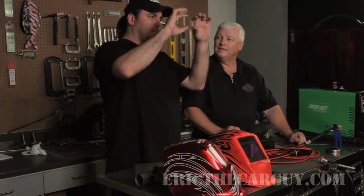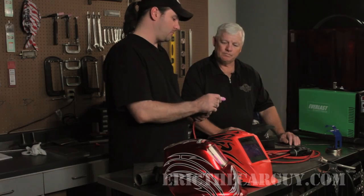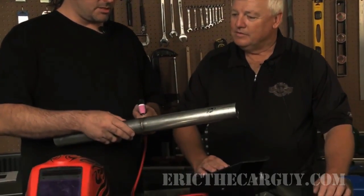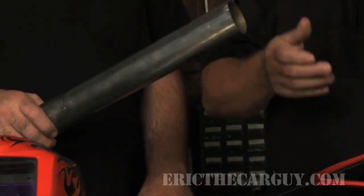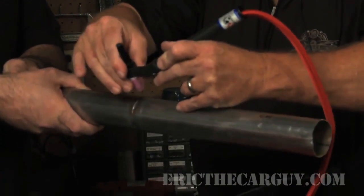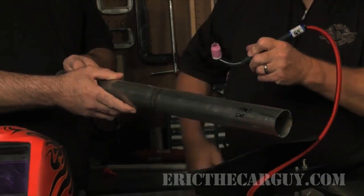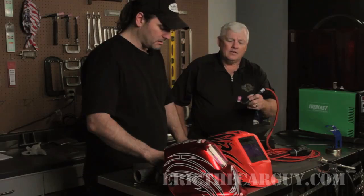We spoke a little bit about cheater lenses that slip inside the helmet. These are your eyes — if you don't have that, you're not going to weld very well at all, especially for long periods of time staring at little tiny bright spots and following along a piece of metal. So with this flexible head, would I be able to use that for when I'm underneath welding a piece of exhaust or something — kind of like this pipe right here? It would be much easier — absolutely, and you can adjust it according to your needs. I hold a torch like a pencil. I can just wrap around and tweak this torch head exactly the way I want and weld all around, then crawl and readjust as needed. Unlike the rigid setup that we had before. Yeah, the rigid setup makes it a little more difficult.